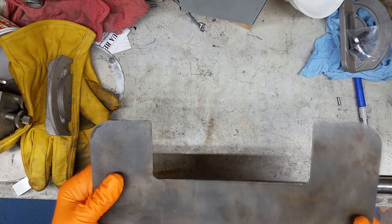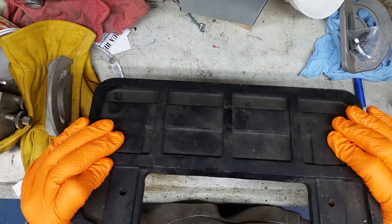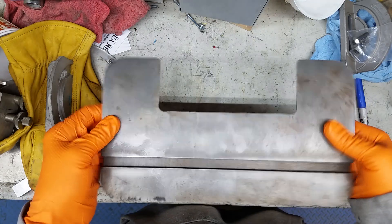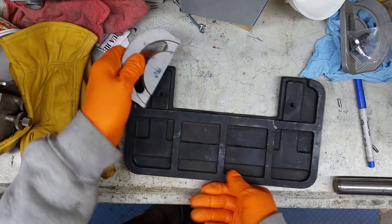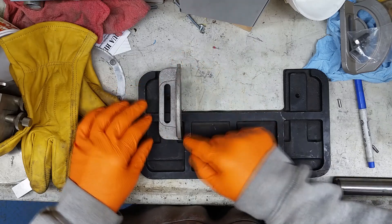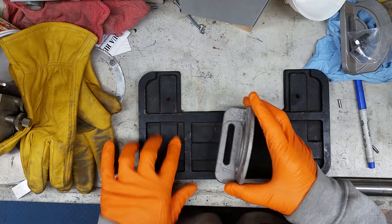My hope here is to make a grinder for sharpening carbide, and I bought this plate. It was supposed to be a tilting table, but the guy that sold it to me — it showed in the picture and I didn't catch it — the problem is this rib here. These are not the angle plates that go with this because this rib's in the way, so it won't sit proper. What I need to do is just machine this rib off so I can get that on there.